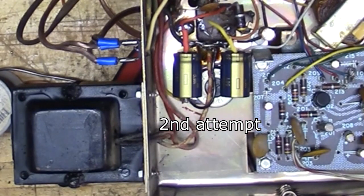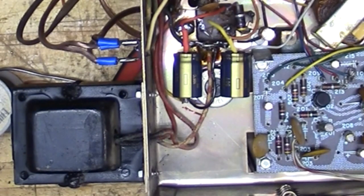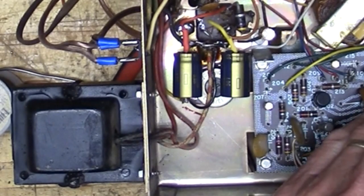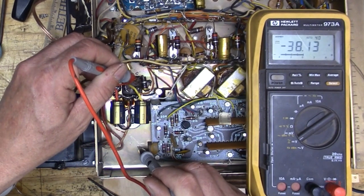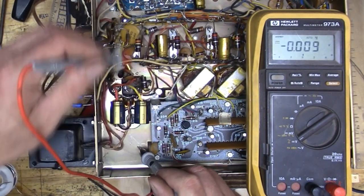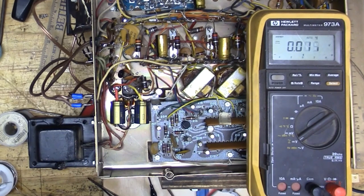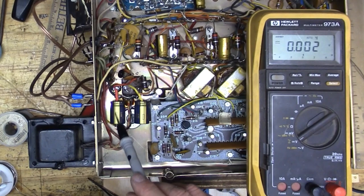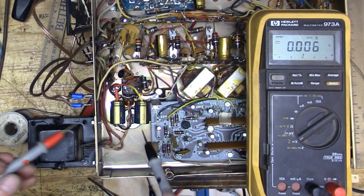So I made a big mistake when I did this the first time. I had the negatives going to ground, but that's not the way this thing works. If we look here and we put this to this and this to this, it's actually that the whole circuit is negative, right? And I knew that, but I wasn't paying attention. And so I put these in backwards and I flipped it on and the dim bulb tester flashed at me and I was like, okay, well, something's screwed up here. So I pulled one of the caps and all of a sudden the dim bulb tester went out